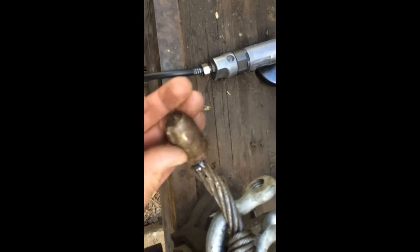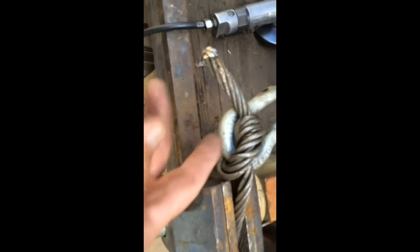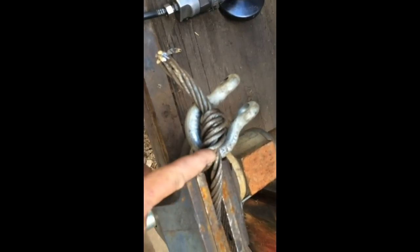What I've done is served the end with some stainless steel 0.032 wire — I wrap the end before I cut it. This stops it from unraveling; otherwise the cable can splay out. Then I'll undo it after, but that holds it closed up while I work. I cut it off with a pneumatic cut-off wheel and cut off the knot so I can get the shackle out — it's a good shackle. Don't ever tie a knot in a cable. It totally ruins the cable — even if you undo it, the cable will be ruined. Strength reduction and other issues — something not to do.